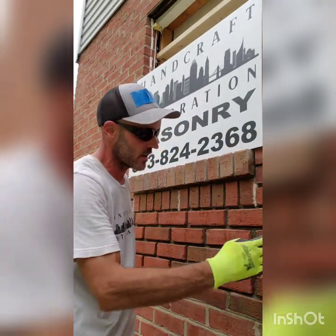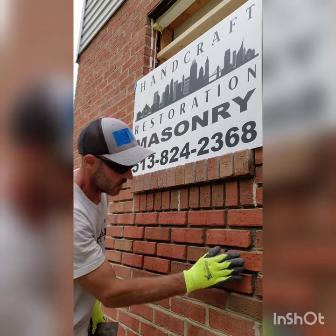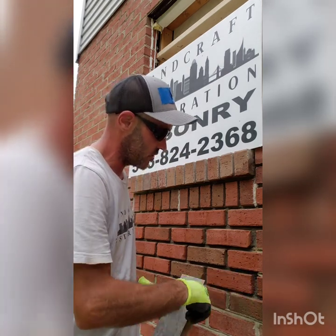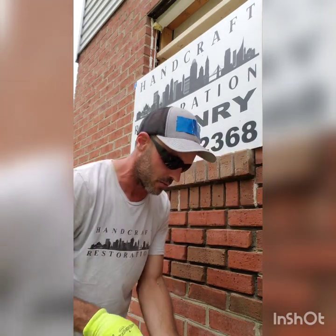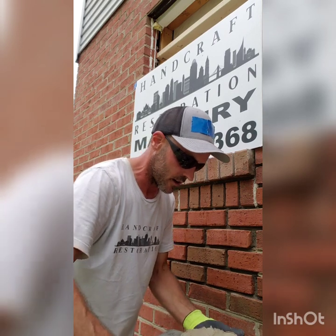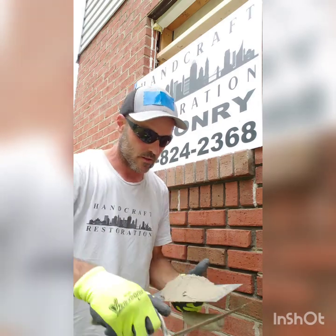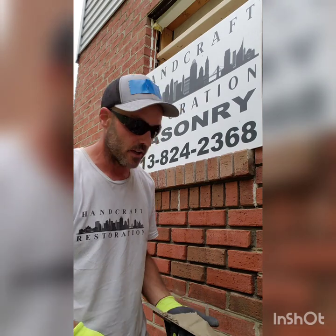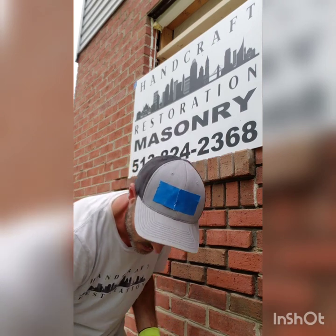You want to make sure your wall is not sopping wet — you just want some moisture in there so that the old mortar can help our new mortar bond to it a little bit better. So I'll get just a little bit of mortar and kind of do this slow so everybody can see what I'm doing at first. I'm going to start with a small amount because while you're learning and getting your technique down, you don't want big gobs of mud getting on your brick.